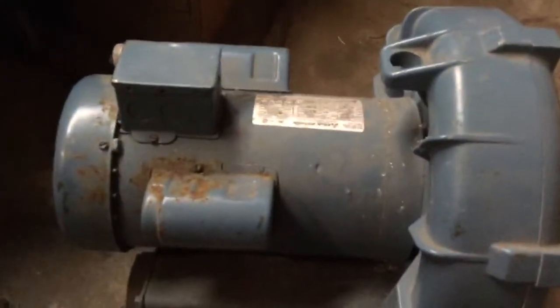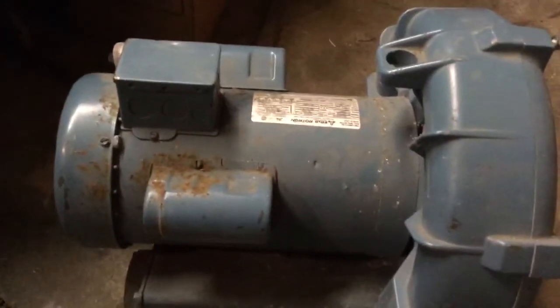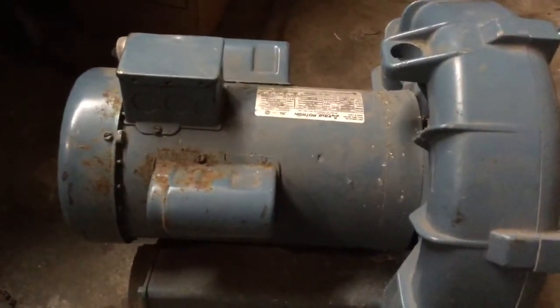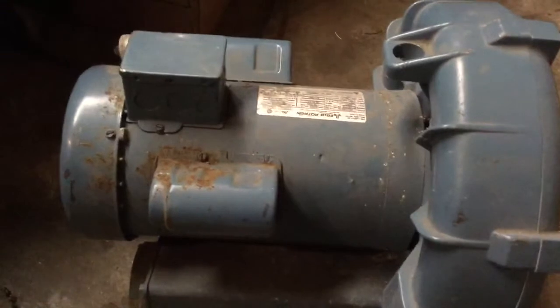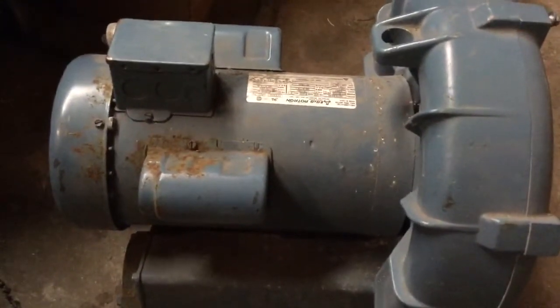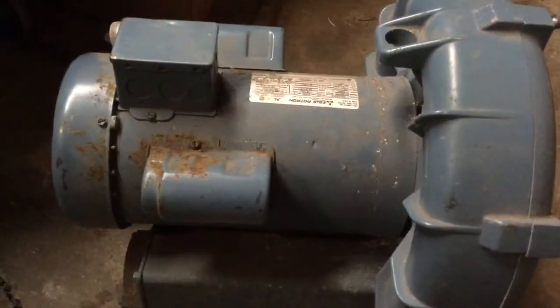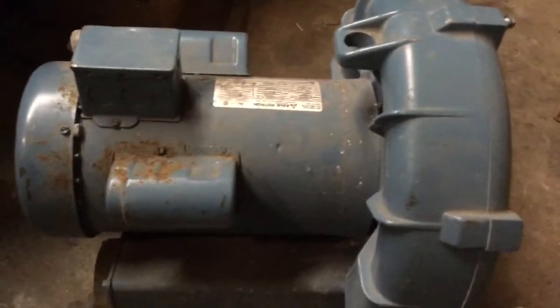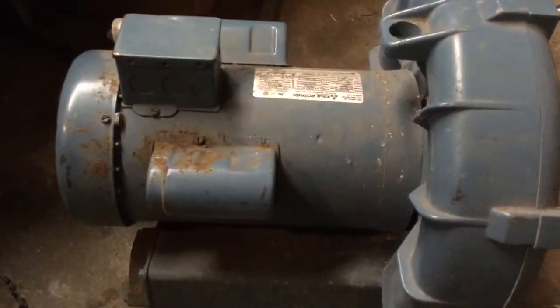So if you want to use a centrifugal design, you need a lot of stages — usually six to ten impeller stages like in a Spencer turbine blower — to get 50 to 100 inches of vacuum at the end of the hose. That's what's needed, but this regenerative design came around, I believe, in the 70s.